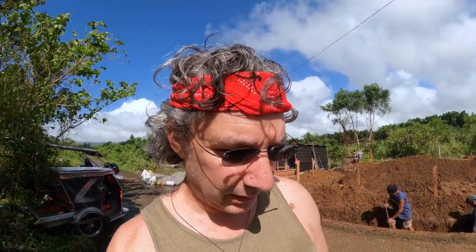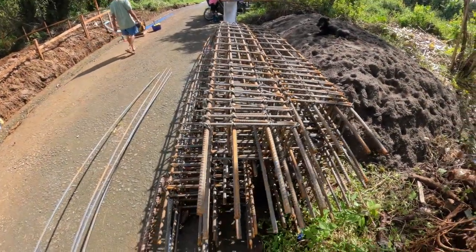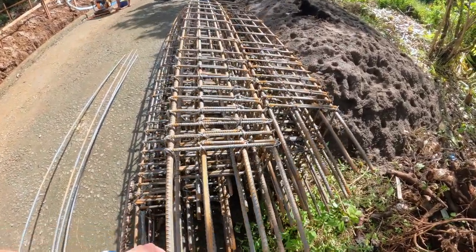While they're working on the water pump, I want to show you the rebar supports they've finished up — these are for the columns. For some background, the original design of the garage had three columns in the middle, and I didn't want that because I'd rather have an open floor plan. The engineer said we could remove those three columns but beef up the perimeter columns and also beef up the structure for the roof.